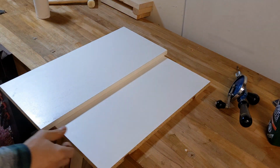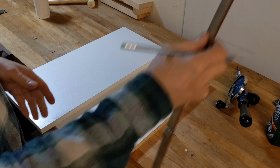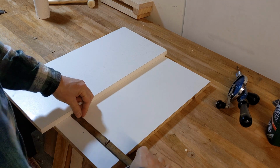Okay, everybody uses a different plane for shooting, so it doesn't really matter too much. But think of the widest plane you would use. For me, that's my wooden planes, and they're about 3 inches. So we'll give ourselves a 3-inch runway.